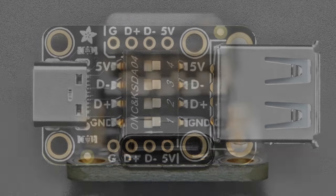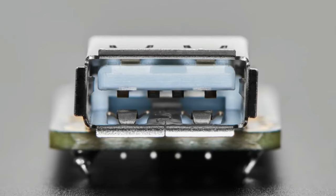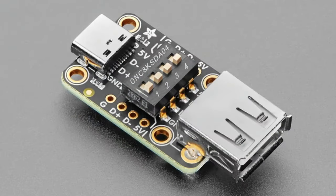Like I said, the only downside is these DIP switches are only rated for 100 milliamps, but you could probably pull a couple hundred milliamps without too much issue. Just don't do it a lot. Don't tell anyone though. And don't switch it while it's powered, so you minimize the arcing while switching the power lines.